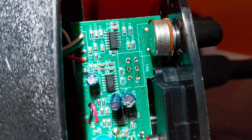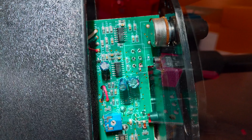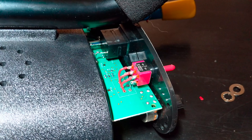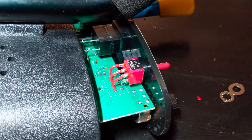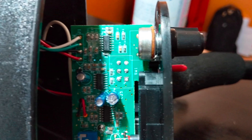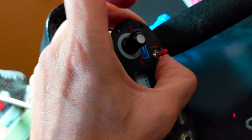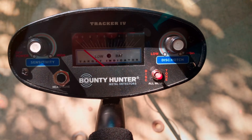I got all the wires bent and properly inserted, so now it's just time to flip the board over and put some solder on. The switch is now in place. I used a little flux remover to clean the board up when done — just to make it look nice and neat. We're going to button this thing back up, and it looks much better having a switch that actually does something again.